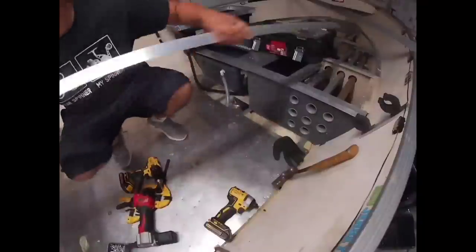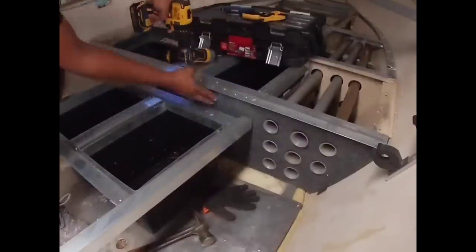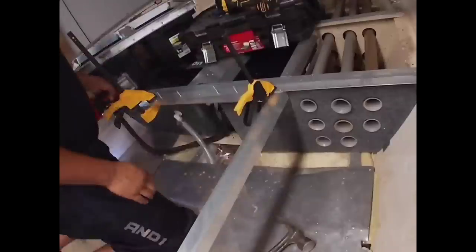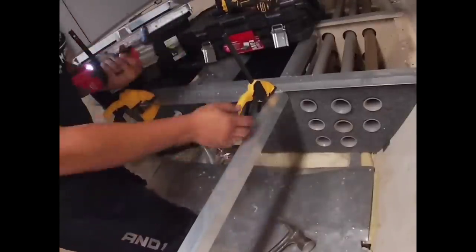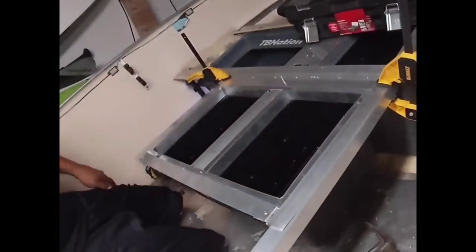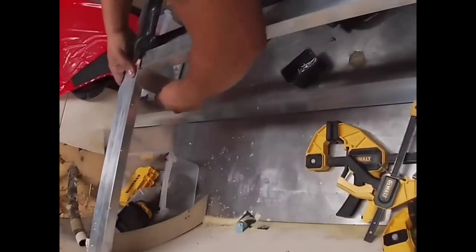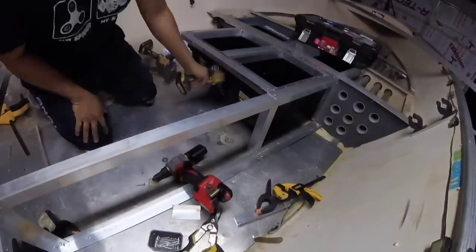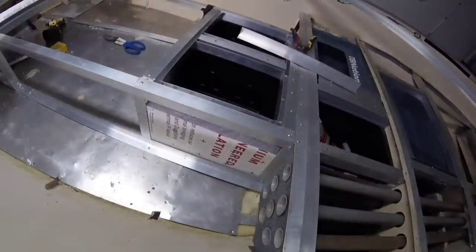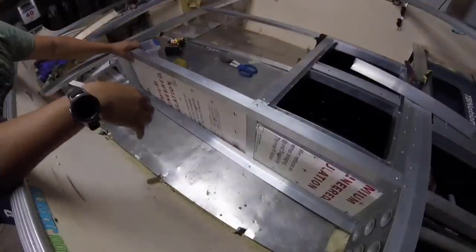The goal is to make as many spots on your boat that can be overtaken by water as small as possible. So if water gets into your boat for whatever reason — you get caught in a freak hurricane or storm, or you get a gross tear in the side of your hull — if there's a lot of foam there that's significantly lighter than water itself, water can't fill that voided space and therefore can't overtake your boat. In conjunction with the hatch system, if your hatches are completely sealed off with drain ports and bleed-offs channeling to the subfloor and out to the bilge, it's really hard for water to ever overtake this boat. That obscene amount of water would have to be all the way to the waterline, and even then I doubt this boat would sink because we stuck so much foam in it everywhere.